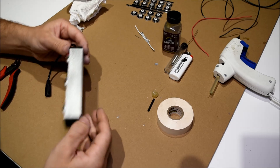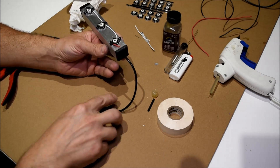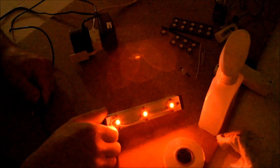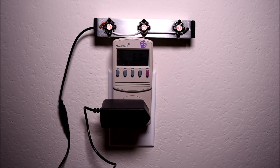We're just about ready to fire it up. I did a little test with a 9-volt, a 12-volt, and a 24-volt cell phone charger and there's no difference — the output's the same. I run it on a Kill-A-Watt and it's the same dissipation at the wall, so the DC bucking driver can adjust for that. Here in the dark you can see it's not super bright because it's not meant to photosynthesize plants, it's just sending them a signal. It works first try. The maximum wattage would be 9 watts since it's three 3-watt LEDs, but we're running at 700 milliamps so — spoiler alert — it ends up being 6 watts.